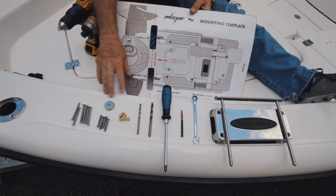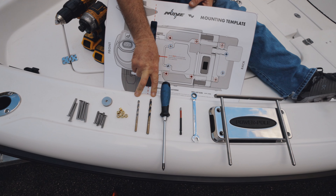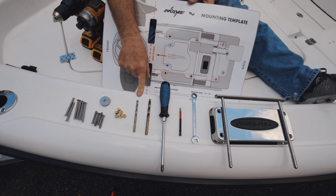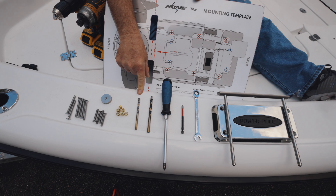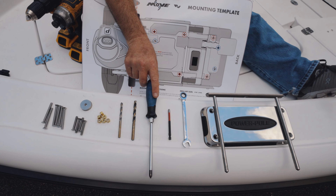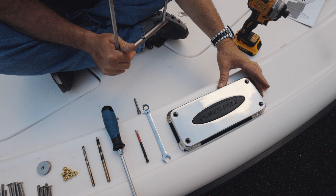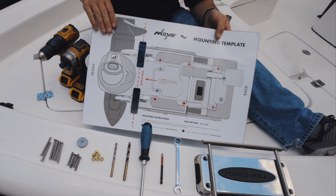Here's the hardware kit for the mounting pulpit. Here are the drill bits to ensure mounting location on your boat: 5/16ths and a quarter inch. You can start with a quarter, and if you run into any alignment issues, you can drill out to 5/16ths — no bigger than that. Number three screwdriver, 7/16ths ratchet wrench. Here's your quick disconnect bracket, your pin for that bracket, and your mounting template provided in the box.